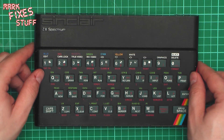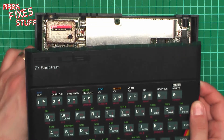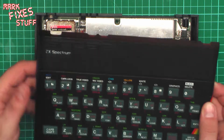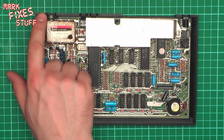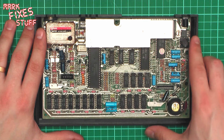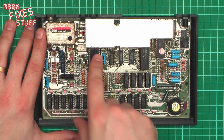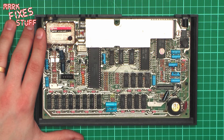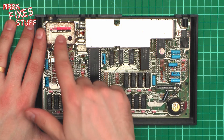Pop the lid off. If there was a membrane here you'd take the tail of the membrane out and we'll just move that to one side. Here's the Spectrum. Now the video circuitry actually goes into this part here. Here we are with the Spectrum, and what you'll find here is this is the modulator which takes the video circuitry, has two wires which basically output the video and power to this modulator.